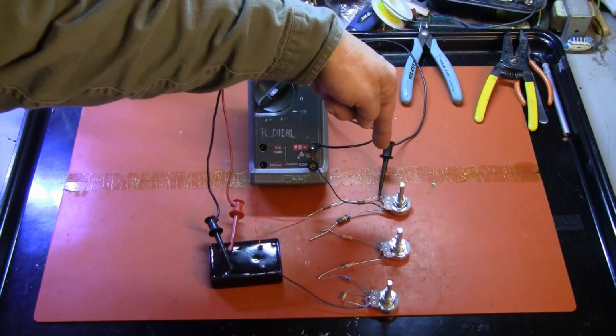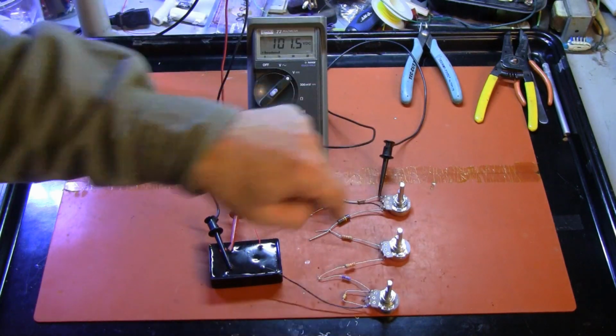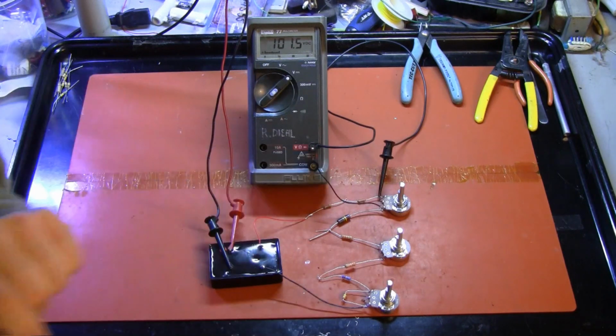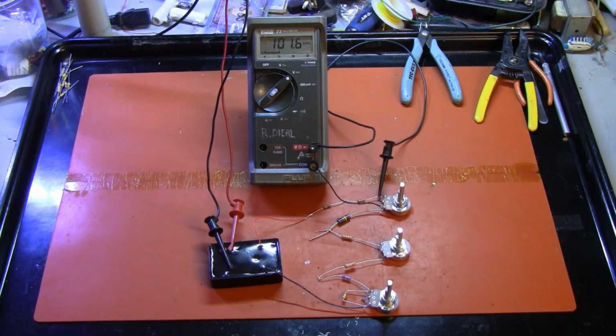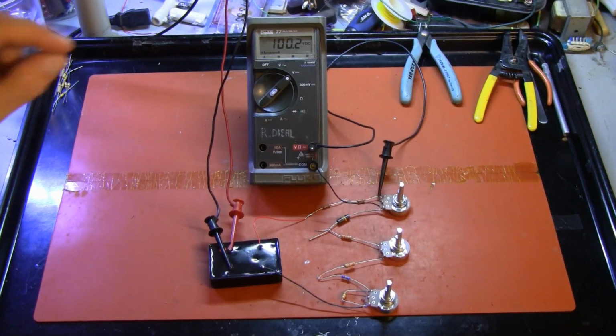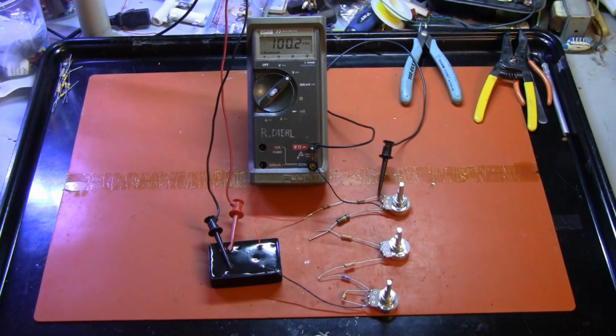Now, that's 100 volts from this ground in the middle of this string to the top of this resistor. Because it's a 100K resistor running 1 milliamp, it will drop 100 volts. So we could do some fine twiddling with our power supply voltage and make that exactly 100 volts if we wanted to. There we go. So there's no need. The resistors are not that accurate. So that is our 100 volt point and our ground point.